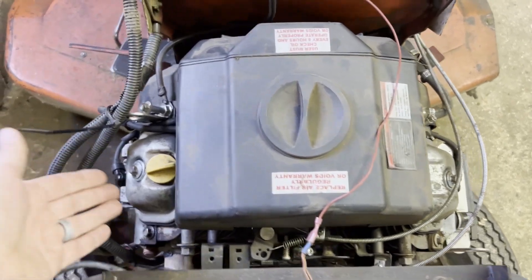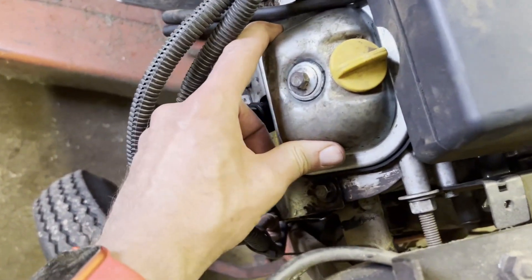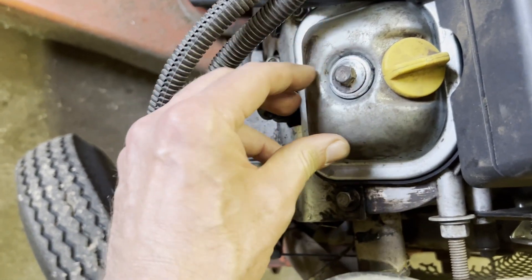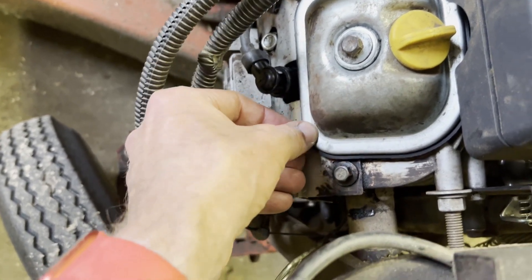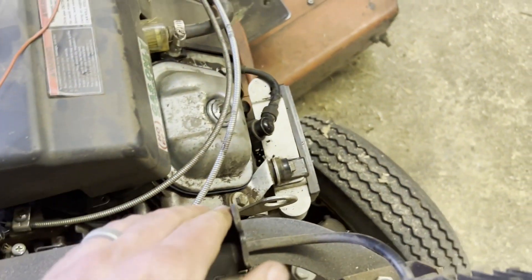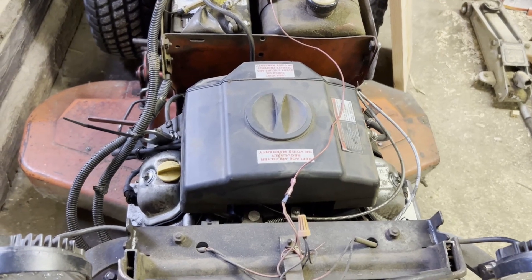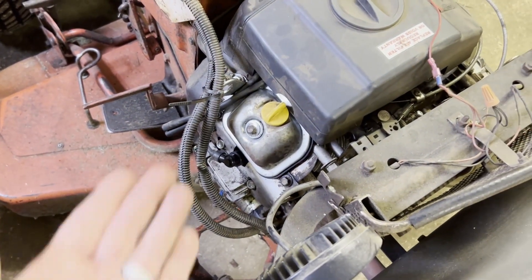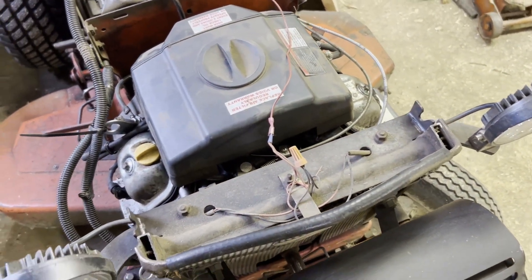Covers are back on both sides. I don't have any particular torque specs for these — I just went with snug, knowing that these are rubber gaskets that need to compress down. I didn't want to over-compress them in case there's any unevenness to the head that might cause a leak. I'll keep them snug, and if I see any seepage maybe I'll tighten them a little more. The next thing is to get the tractor outside and get it running to see how they do, but that won't happen today because it's raining. Super easy job overall — we'll see how it goes.